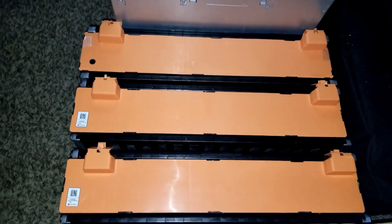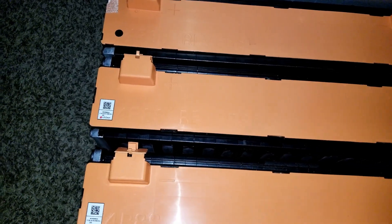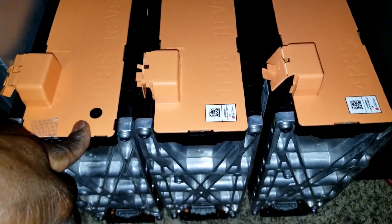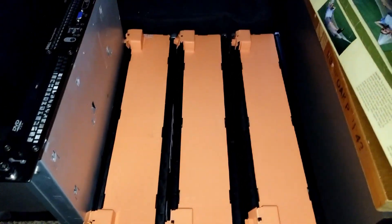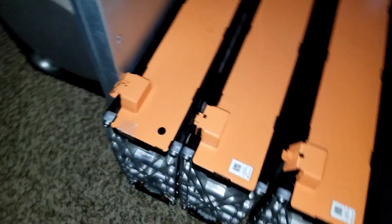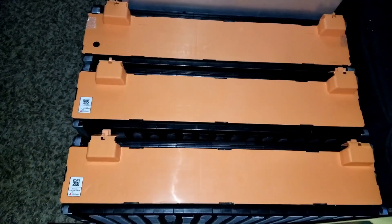Before we end the video — you can see some massive batteries here. These are LG Chem, and like I told you guys, I've been preparing for this transition. These are 24-volt modules, and each one is 8.5 kilowatt — 8,500 watts — at over 260 amp-hours each. I'm still waiting for the next module; then I'll have four of them, to be incorporated into the Victron energy system. And the Command Center is still rocking. We're talking about the second generation of the Command Center — all in Victron.